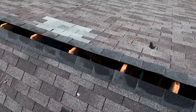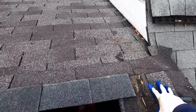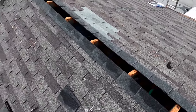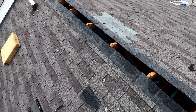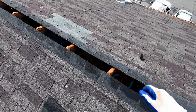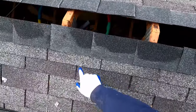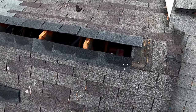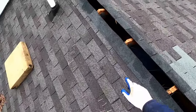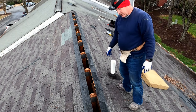Okay, now the next thing I want to do is, you're always going to have shingles that are over the ridge up to the point that you start the ridge vent. And I'm installing 16 feet of ridge vent today, which I want to get approximately centered. So I want to measure the length that I have here. And each one of these tabs is exactly 12 inches long. And so rather than getting a tape measure, I can just count these. So it's approximately 20 feet long.